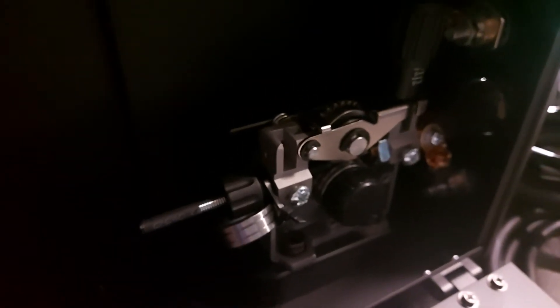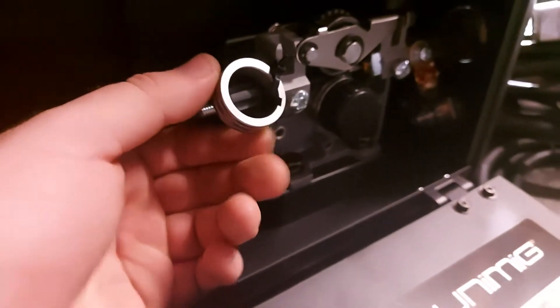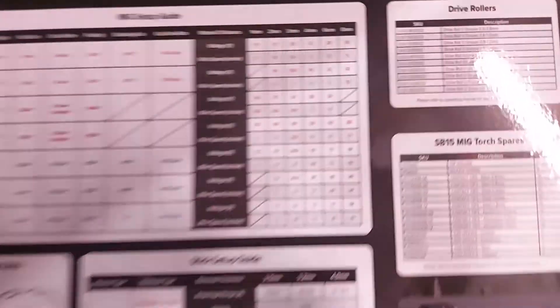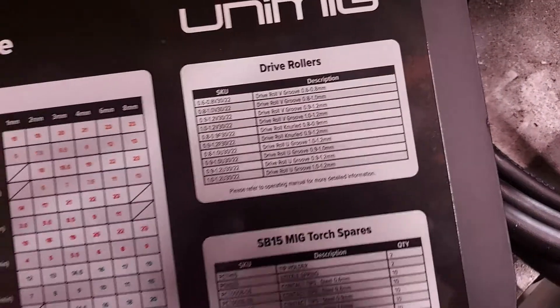Let's pop open the side and have a quick look inside. In there you can see what the wire feed roller looks like. There's another roller in here — a 0.6 V roller — and there's another one on the machine itself which I'll have to double check. That's your tensioner, burn back adjustment, and then the switch in there to convert it to standard or spool gun, which is something new to me — I've never seen that before. Can't wait to play around with that once I pick up a spool gun. That's your drive rollers and polarity setup — I'll leave the detail for the next video.